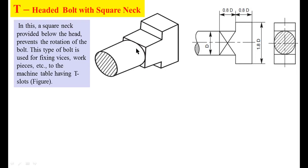The purpose of this T-headed bolt is the same as the previous one. In this T-headed bolt with a square neck, a square neck is provided. This one is the square neck, provided below the head. This is the head. The square neck below the head prevents the rotation of the bolt. This type of bolt is used for fixing vices, meaning carpenter vices, fitting vices, and workpieces like this to the machine table having T slots. So now I am going to explain how to draw the orthographic views of this T-headed bolt